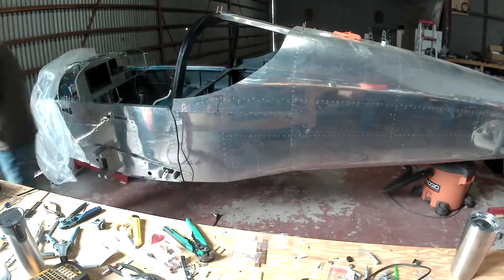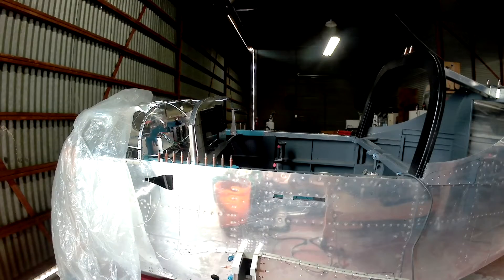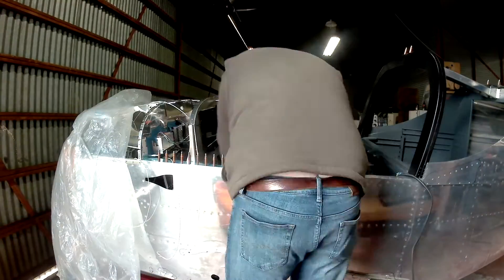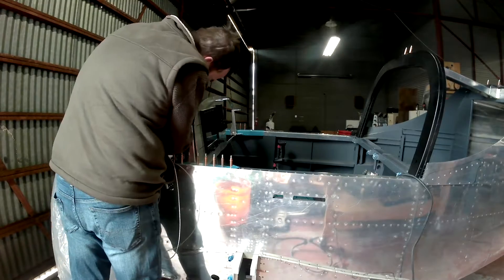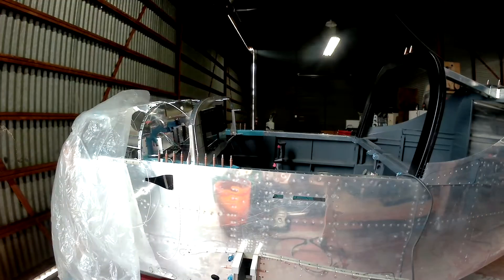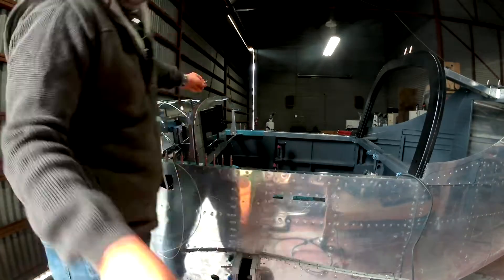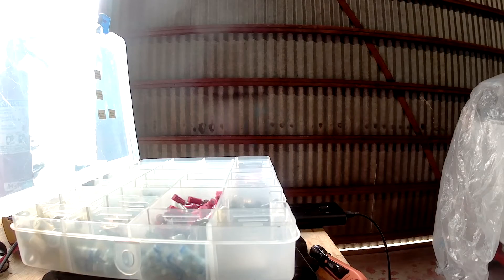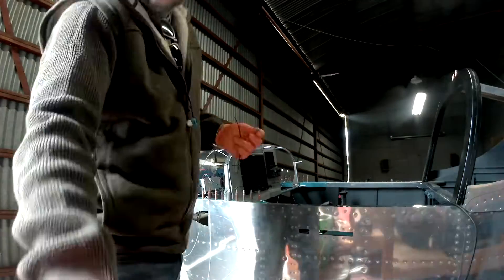Next question: discuss how you analyze and adjust CG for your plane. That's a good question. Vans came out with a couple of documents that are important for anyone building this plane. One is the operating limitations, which includes gross weight — gross weight is based on the airframe and its ability to handle stress. It's ironic because this plane has more power, more G-envelope and speed than a 172, yet the 172 has about 300 pounds more gross weight availability — it's all about the frame.